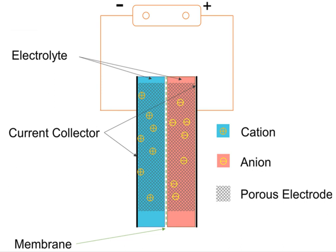In contrast, electrochemical capacitors, supercapacitors, consist of two electrodes separated by an ion-permeable membrane separator and electrically connected via an electrolyte. Energy storage occurs within the double layers of both electrodes as a mixture of a double-layer capacitance and pseudocapacitance. When both electrodes have approximately the same resistance, internal resistance, the potential of the capacitor decreases symmetrically over both double layers, whereby a voltage drop across the equivalent series resistance (ESR) of the electrolyte is achieved.